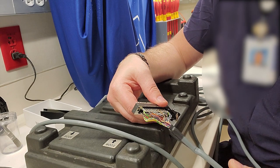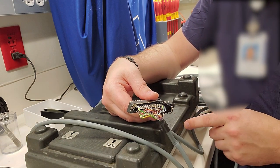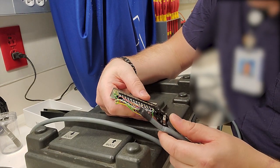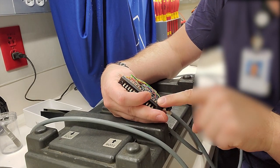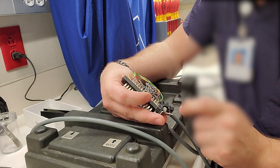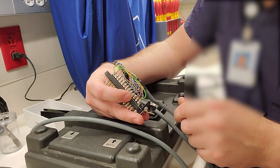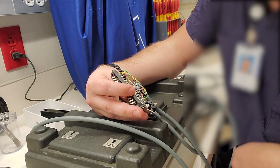Now that the cord is disassembled, take photos of your connector. From what I've seen, it's the exact same cord and foot control for the OPMI microscopes and the Penteros, so it should be the same pinout. But just in case, take photos of both sides at different angles because wires can be hidden behind other wires. I'm also going to leave the pinout for my connectors in the description below so you have a reference, especially if you have a cord yanked out and wires pulled off their pins and you don't know where they go.